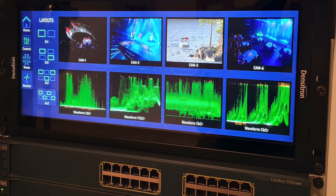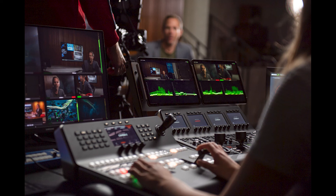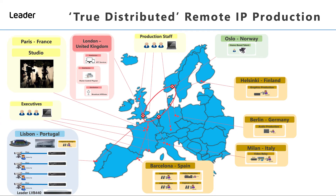In the central equipment room, the Widgets API have been integrated into the Densitron TFT monitor. So, instead of having a fixed monitor layout, customers can build operational specific monitoring layouts and populate the display with the SMPTE 2110-20 and 30 streams. And finally, live production. In live production, not only can the LVB440 Widgets API be used as a multi-viewer display, the low latency operation allows camera shaders to use the Widget API to display pictures and waveform displays for camera shading. This capability then opens up the possibility of true distributed remote IP production, as the LVB440's Widget API can be viewed over a wide area network, allowing production staff to be remotely located, whilst at the same time providing engineering staff with the capabilities to monitor IP streams and services over the wide area network.